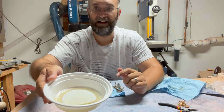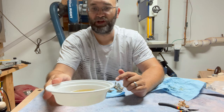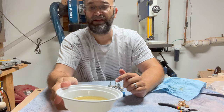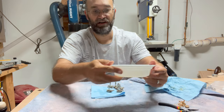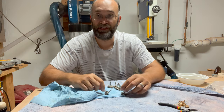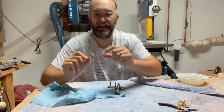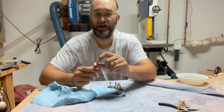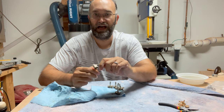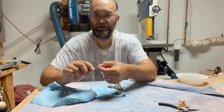Within this container here, this brown color isn't just the WD-40 — there's all sorts of powdery sediment in the bottom kind of floating around. In terms of whether you can use WD-40 to clean vintage tuners, you can. I'm still going to go back and put real oil in here, because WD-40 is not meant to be a lubricant. It will help break things free, but it's not meant as a long-term oil.